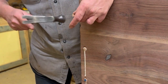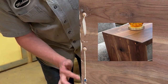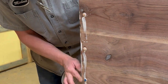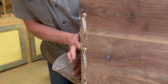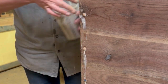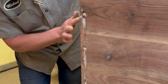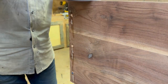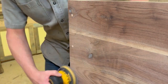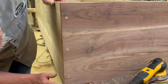All this extra glue running down the face — I'm going to use my finger and use some of that to fill in any little gaps I have in the corner. You can see what the corner looks like when I'm done. I've got some little gaps and I'm filling those in with glue, then rubbing in walnut sawdust. I'm going to come back with the sander while that glue is still wet. While the sander is sanding it's creating dust also, and it just mixes with that glue and fills out any spaces that aren't perfect. You can see there that came out looking pretty good.